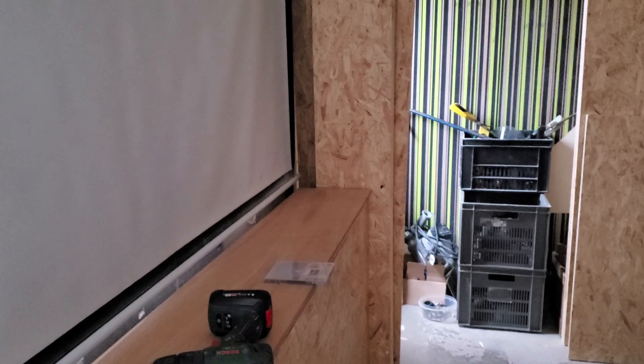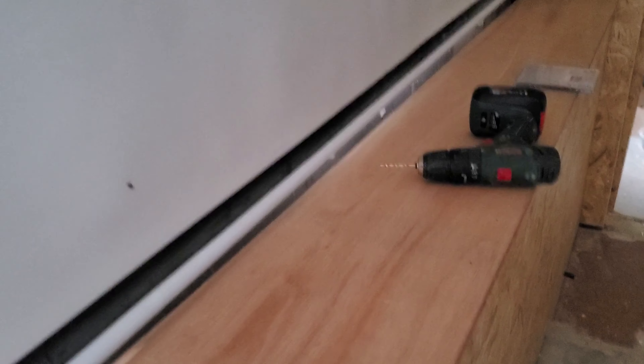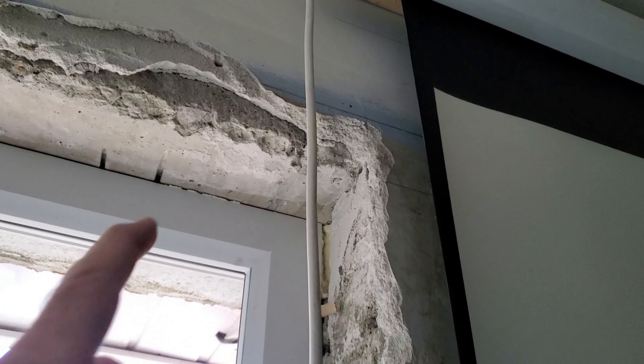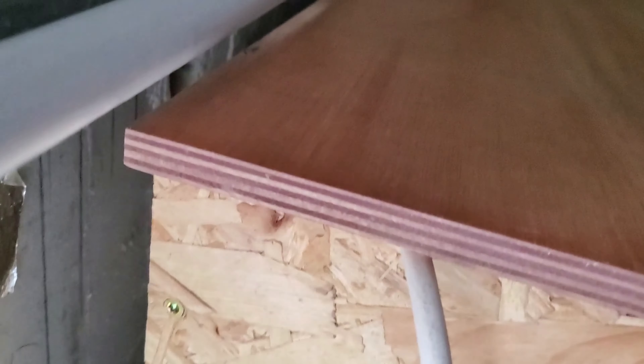I've most of the walls all finished now. I stopped early today, just doing wee bits and pieces. Next thing now is the radiator — I'm trying to order radiators and stuff. But I'm just checking this blind here — it is both straight and level — but the blind is on the wall, and see how thick the plaster is in that wall there, it's holding the blind out slightly more on that side. I could pull the plaster off — that would be some mess. I'm tempted to pull the plaster off — the plaster is very thick on one side and barely any plaster on the other side. That leaves my blind going in behind here — she's just clipping.